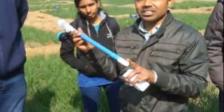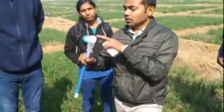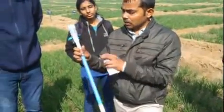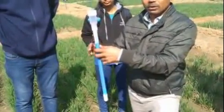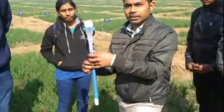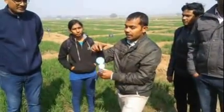Here you are seeing this is actually the ceramic cup — a porous ceramic cup through which water from inside will come out through suction. And this is actually a vacuum gauge where the pressure will be measured. This is the cup inside that we will fill when we install this instrument inside the soil up to 30 centimeters. After that water will be filled, it will come out through this ceramic cup, and the suction will be measured here.